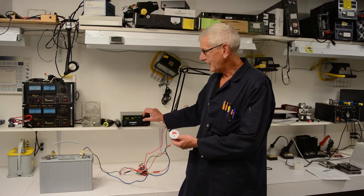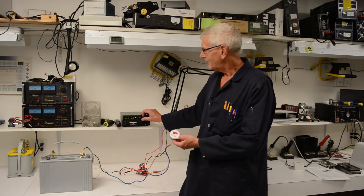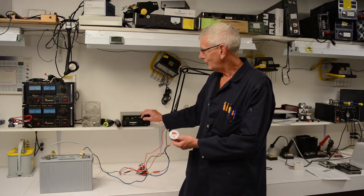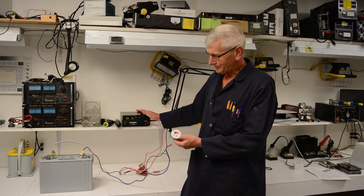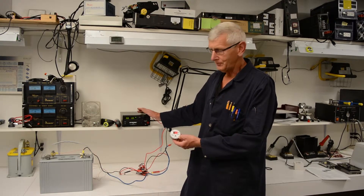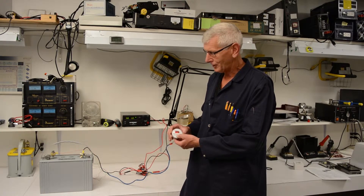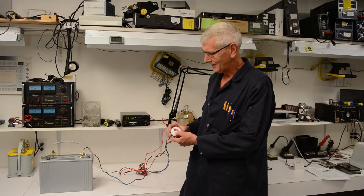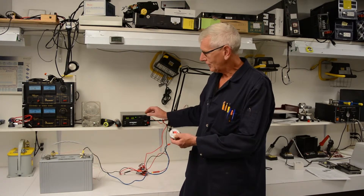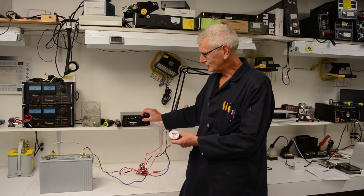The alarming — and that's why I picked this adjustable power supply — if I take the voltage down to, say, a dead battery, which is about under 10 volts, I'll get an alarm on my Battery Watch. I can stop the alarm, of course, now that I know that I've got an alarm system. So I've acknowledged the alarm, and I'll just raise up the voltage again.